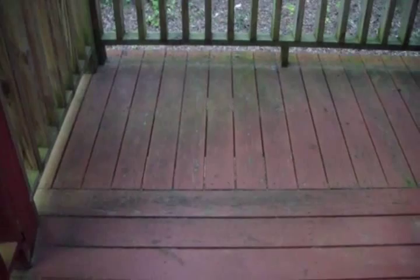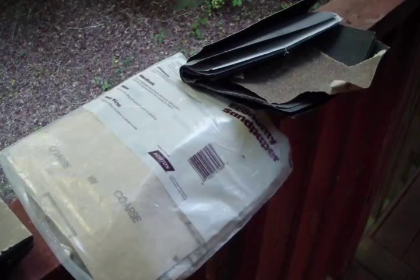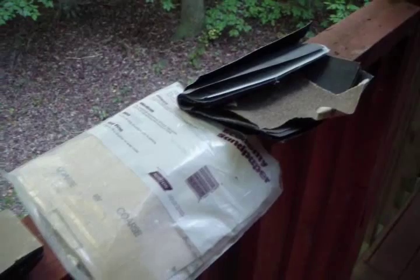We're just going to bring the main cabinet out here on the porch. I want to lay it out and get started, and hopefully I can do the laminate here, because we are having acorns and stuff falling out of the trees out here, and I don't want stuff falling while I'm waiting for the glue to dry for about 10 or 15 minutes, because you have to apply it to each side that you're putting together. You have to put it on the cabinet, and you have to put it on the laminate. And then after it starts activating for 10 or 15 minutes, if it's not leaving any residue, like you can check it with a little piece of paper or something, if it's just kind of tacky, then usually it's ready to stick together, and it'll make a permanent bond when you put the two halves together. So we'll get the cabinet out here and start sanding.